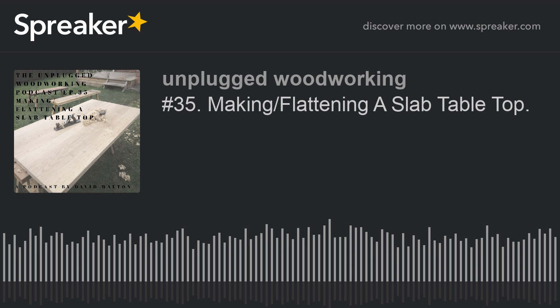To be honest with you, I don't often use the camber iron, because you can get away with just using your regular iron. And I do normally do that, but with so much work to be done, I decided to dig it out. I got it razor sharp. I took my time, got it nice and sharp, and basically I started just hitting the middle section. So I was just working my way up and down the board, hitting the middle section.